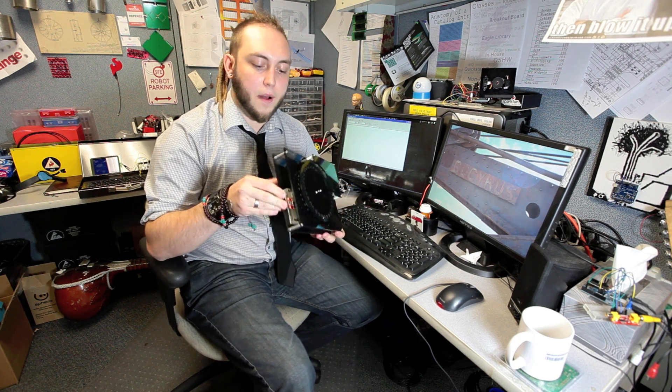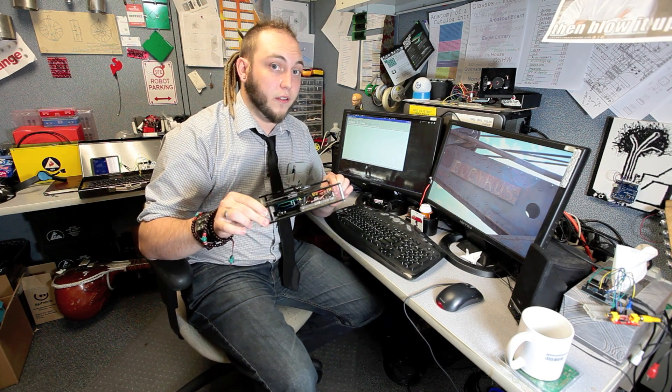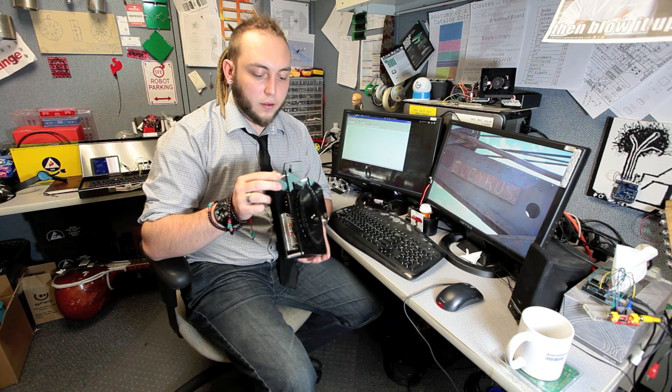I've also rigged up a little circuit that's been featured in Practical Arduino. It's a USB keyboard circuit that uses a couple of diodes for level translation from USB to the 5V Arduino system, and a little bit of bit-banging firmware on the Arduino that copies the USB HID protocol.